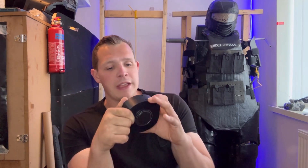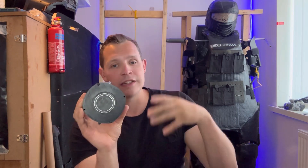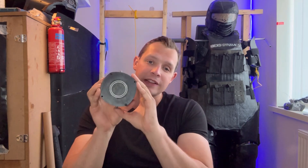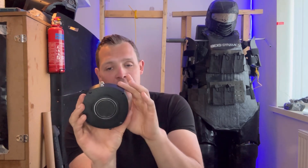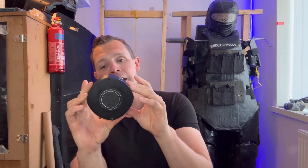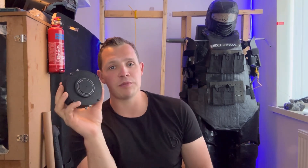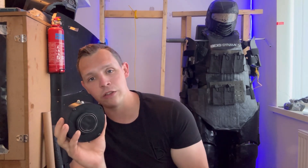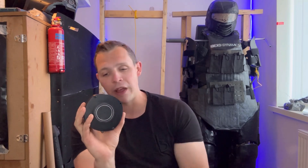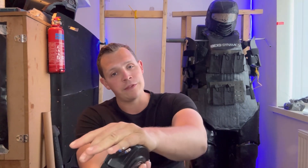I'm going to put this on Patreon in case you want the design, probably over the next day or two. One thing I'd recommend if you're going to use it is making more bolt holes and maybe making this completely round. The reason I've done it like this is because I believe this is what my electronic actuator is going to look like in terms of size and bolt pattern, based on phases, magnets, slots, and the gearbox. If I was just making an elastic one, I'd probably make it round — it's slightly over 100 millimeters in width so maybe I'd target exactly 100mm. I'm now going to get another seven of these printed and fitted. Next week's video will be the legs, then the boots and ankles, and I'll be fitting a robotic hand in there as well. I hope you enjoyed the video — please like and subscribe, I've got plenty of things coming on the channel not just exoskeletons.